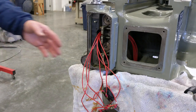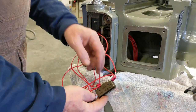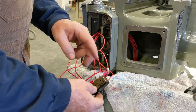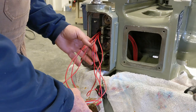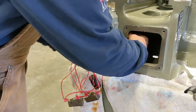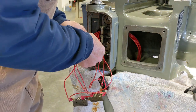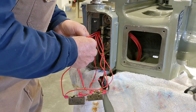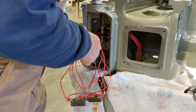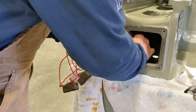So, wiring up the electric lead screw. I didn't show you hooking these wires up. When I took this apart, I took the switches and wrote on the switches which wire number it was. What we've got to do now is get these wires shoved back into this cavity so there's not too much excess wiring. Also, there's kind of a tear in the insulation on this wire — it doesn't appear to go all the way through, just the outer shell. So let's get these fed through there.